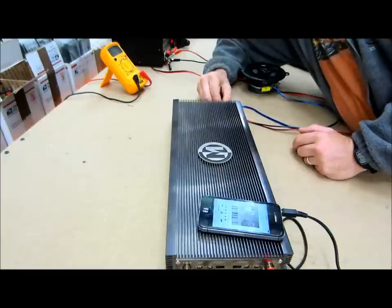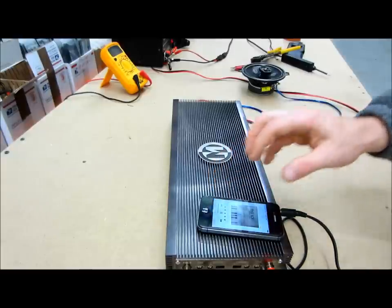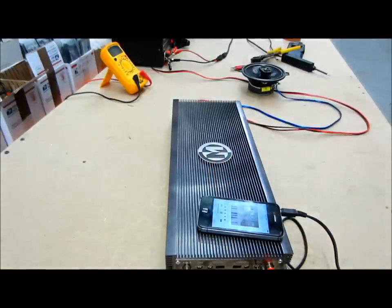I'm just going to turn the volume down a little bit. You're going to want to test your crossovers and make sure there's no scratchiness on your gain — that's important because you could be hitting bumps while you listen to your sound system and it could drive you literally insane. Over here it's on high pass filter. Switching to flat, I noticed there was much more low end and it sounded more full, so I know that's working. Low pass filter is just all your super subsonic low frequencies — I can see that this is working very well. Then I'll put it back to full high pass.